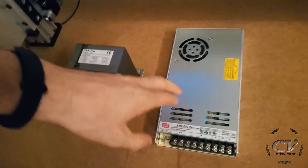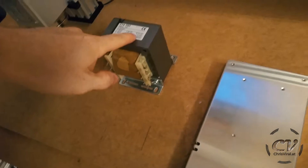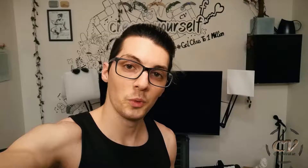So this is the regular transformer — quite heavy and large — and this is the new switched mode power supply. What this does is, first of all, it shifts the frequency way up so that the transformer itself can be a bit smaller, then shifts it back. But the key thing is this is super efficient, and it's basically used in all smartphone power supplies. The regular transformer has a massive iron core, and when it's plugged in and gets in contact with AC, this iron core creates a magnetic field that switches around all the time — and this is producing quite a lot of heat.